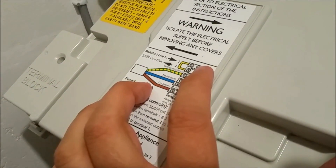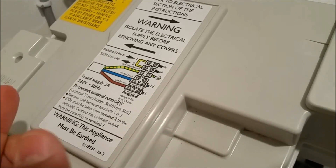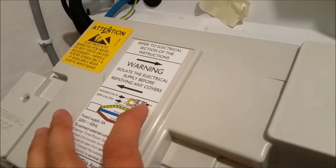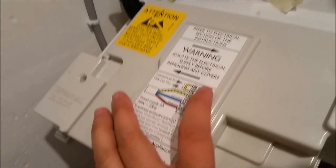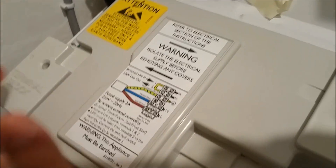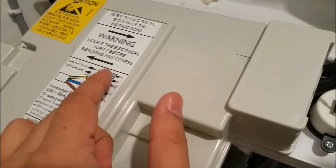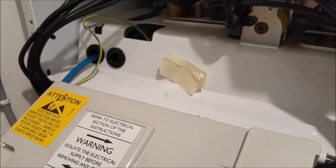Everything is open now. I'm going to connect the power for this unit via live and neutral, and the connection that calls the radiator on and off using this wireless internet thermostat is right here. At the moment it's got a link in it, which means you can use the timer already installed on the combi boiler. When the thermostat calls for heat, it just makes a connection here — that's why I connected a normally open contact. I need to remove this link and connect normally open to common contact, and keep the link safe in case I need to remove the unit in future.